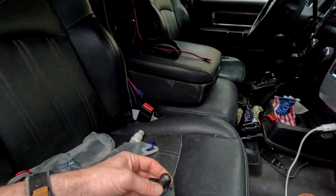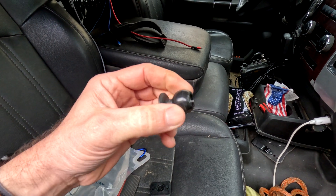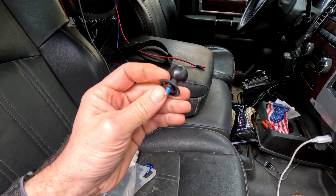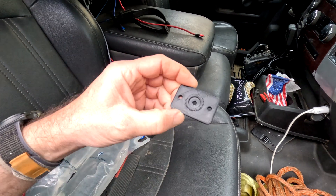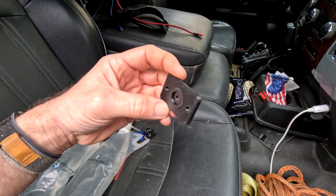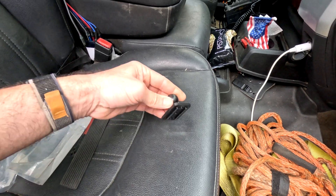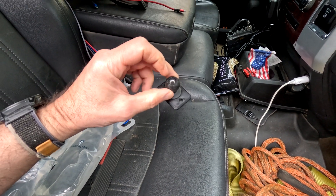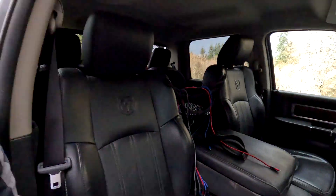I got to thinking, and I realized that when I bought that Quadlock 2-inch arm, it came with this ball right here. It's not really harder, it just feels grippy and rubbery. I decided I wanted to use it - it's got Quadlock's proprietary spline gear mount system on the bottom. So I spent a few minutes in Fusion and designed an adapter that fits on my little rail that's got that gear assembly on it. This just pops right onto there. I did not have a number 10 countersink bolt that was long enough to go all the way through and bolt onto the rail on the bottom, so I'm waiting for that to show up. Once it does, it's straightforward - I'll just swap one ball for the other, and then the system should hold into place quite nicely.